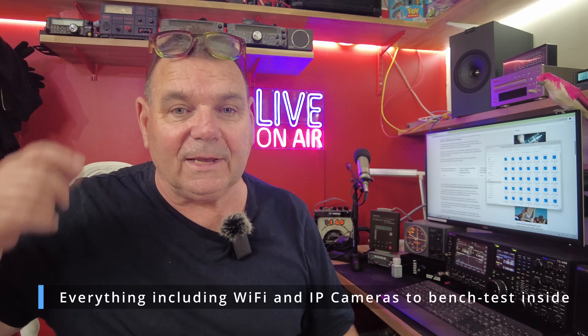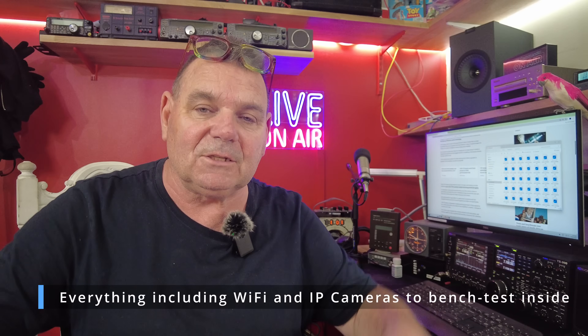What I've got to do now is wire everything up in here, get the rotators sorted, plug it into this switch and that switch, wire it all up, and make sure that when I select an antenna I hear all the right relay clicks. I can get the multimeter out and verify it actually works. There's also the PTT lockout project — that's not completed yet. We don't want to be transmitting and accidentally change antennas with a mouse click, because as the relay opens while transmitting it will arc, blow the relay, and make a mess of it.